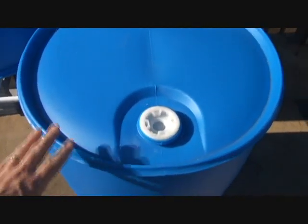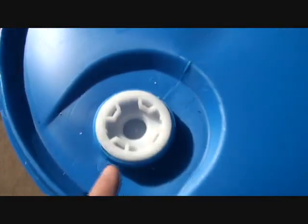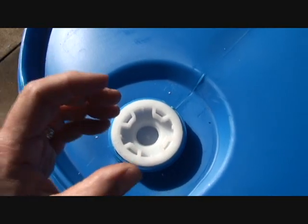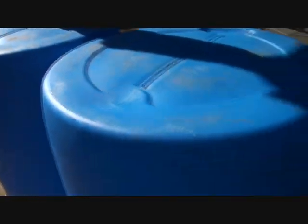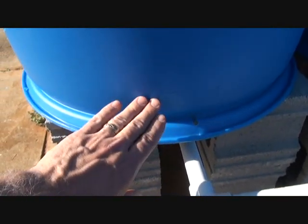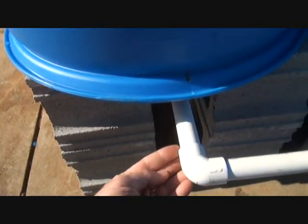From the grate it goes straight down in, and then there's the water. These barrels come in different configurations — this one is sealed with no detachable lid. It does have bung holes that I used. You have to bust out the cap; it's threaded 3/4 inch. So I took a regular 3/4 inch PVC fitting and screwed it right in, then came in with an elbow. I turned the barrel upside down so everything comes out from the bottom, which keeps the water from stagnating.